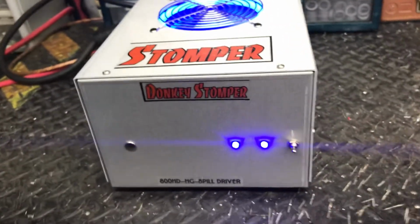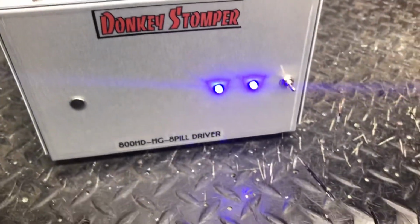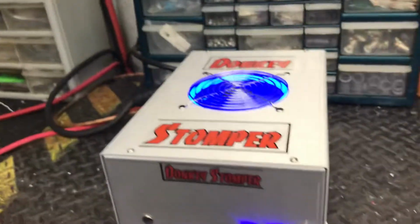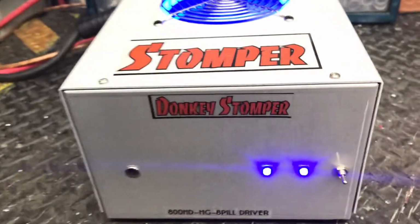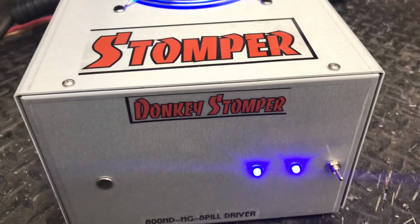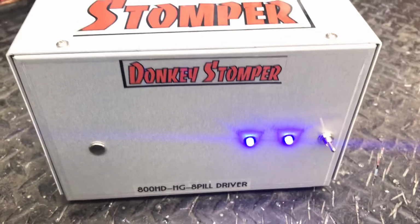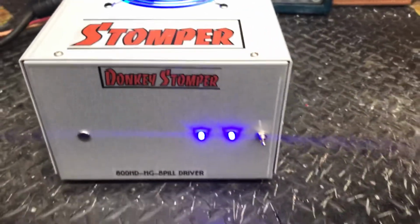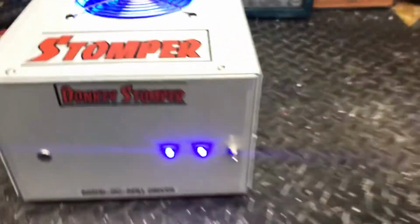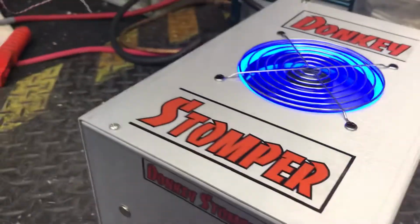The guy I'm building it for can turn his power supply to 16.2 or 16.3 if he wants to, if he's just going to use the regular radio drive. He's got a 2995, and the idea is he's going to run radio drive. He's got all AC mod stuff in it, loaded up with AC mod 2995s. Then he'll turn the amp off in it and drive it into this, to drive the 48-pill. Should be nice, and smooth too.